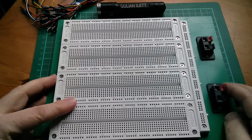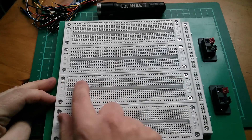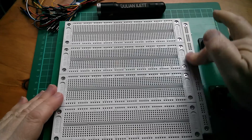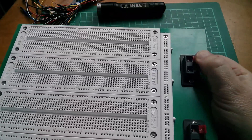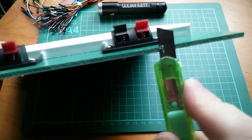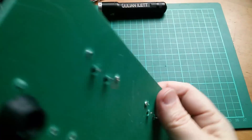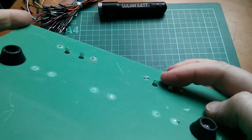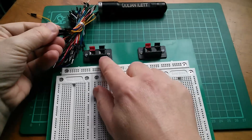The SYB-118 boards have 59 rows, which is a bit strange. There's a two-row power distribution strip at the top with spring-loaded speaker-style contacts. The base board is really thick solid plastic. You could hook up your power supplies to solder points here — standard tags with holes — and then use jumper wires poked into the SYB-118.